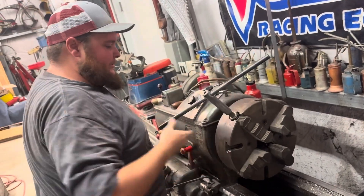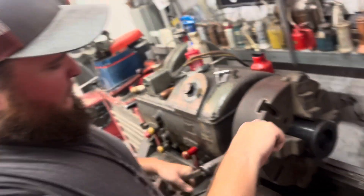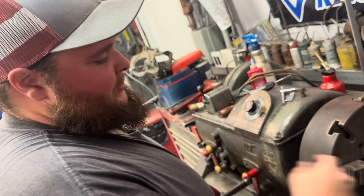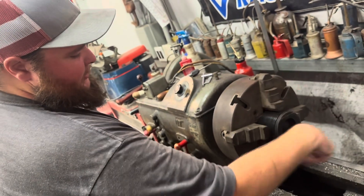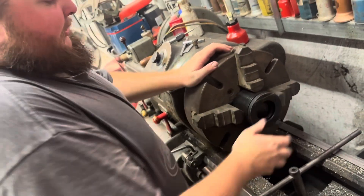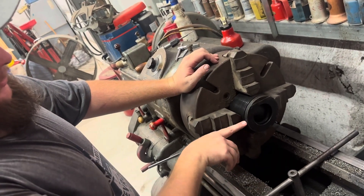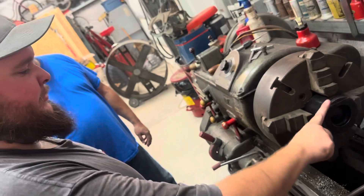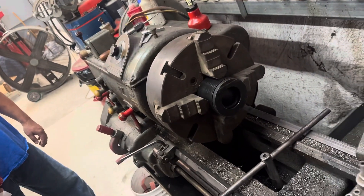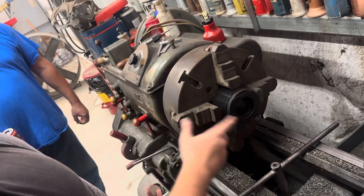We've got some tape on the piston. The piston is now in the lathe — this is the fun part of getting it perfectly centered in this big four-jaw chuck, which is going to be a pain in the butt. We'll put a dial indicator on it and spin the machine up. As long as we're less than a thou of runout, we ought to be centered enough. Then we can just start cutting it as we please, and we'll do all the machining with it still in the chuck, because as soon as you pull it out, you change where the center is.